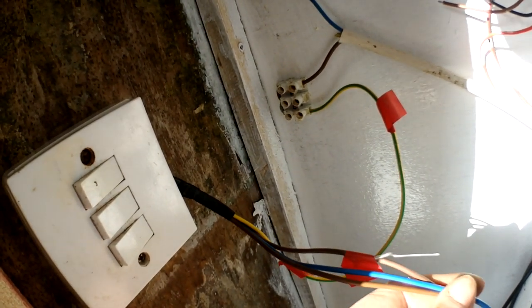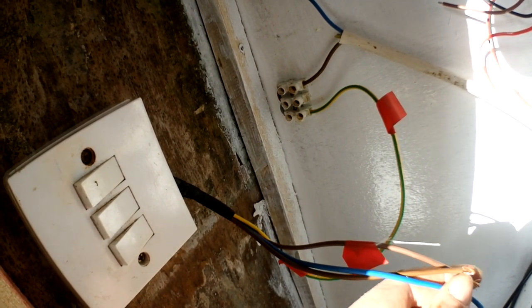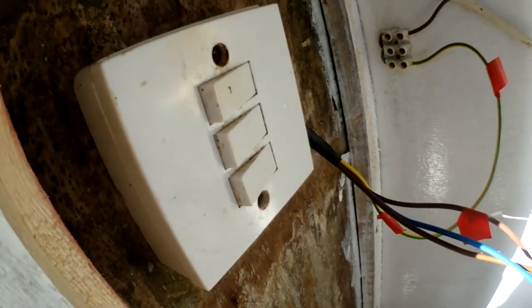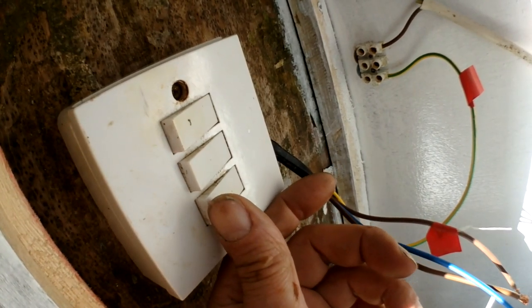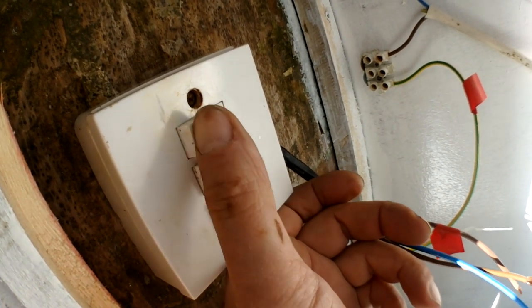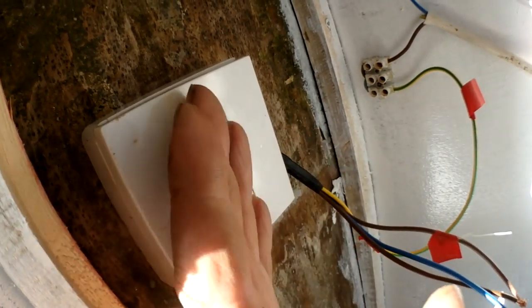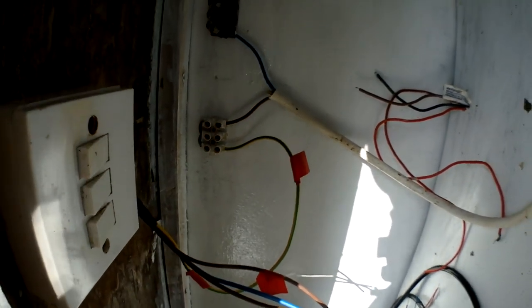These switches here each come out one line — three of them — which are all going to be live. Basically this is the live power that goes to pumps, lights, sounders, that kind of thing. Three of them: I've got the GPS, the sounder, and the override for the bilge pump. I'll have a separate switch for the deck light, just a small switch in the corner. When you put these on it'll turn power to the sounders or switch the pump on, and every day I turn these off to isolate the power.